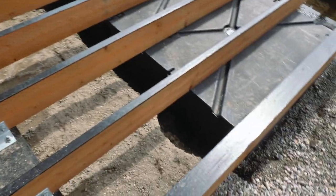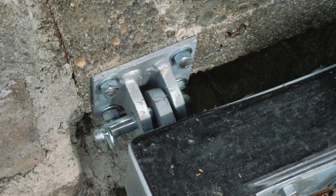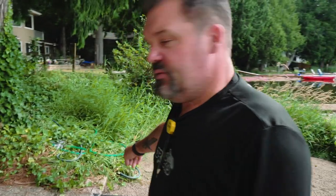Now let's talk about how we mounted this first section. It was the trickiest because we had to do some digging. This lake changes elevation probably one to two feet between summer and winter. That's why when we attach to the bulkhead we needed hinges — so each dock has the ability to raise and lower with the water elevation without any pinch points. The concrete was a little brittle, but the hardware from Scott Co Marine was great. They did the layout for me so I just had to identify which bracket goes where, pin it together, lock it with a cotter pin, and it's dialed.